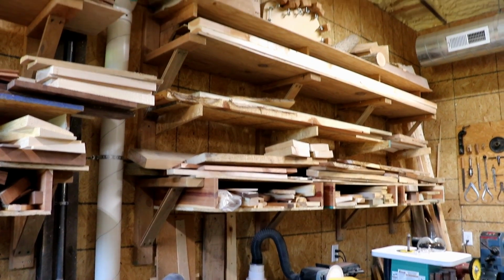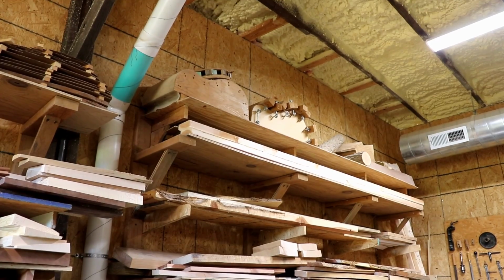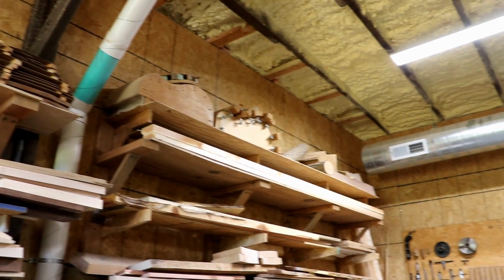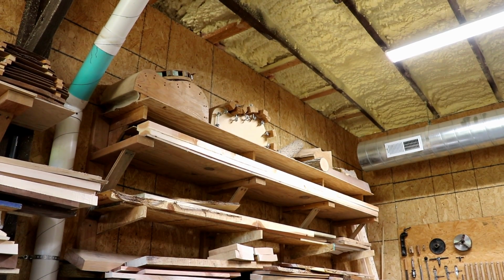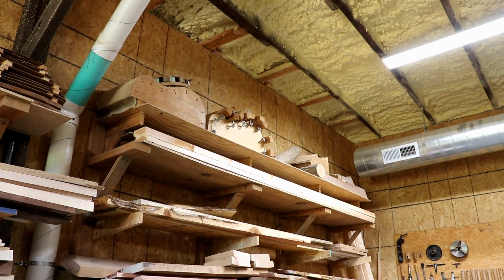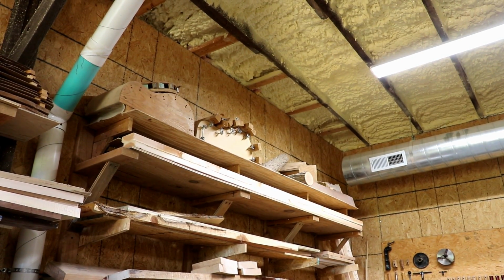Back to guitar building. You can see up here I have a couple of guitar molds up on the top. I don't really use those anymore. What they were used for, you can see the blocks on the one on the right, in those eyelets, you can take a set of sides, boil them in hot water, put them on there, and then pull them down to the mold with those long blocks that go across there. I don't really use that anymore since I built my better side bender, and we'll show you that next.